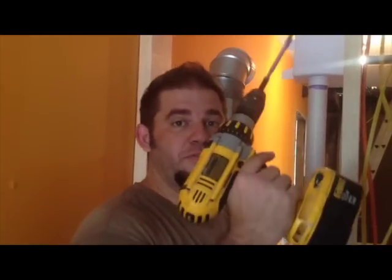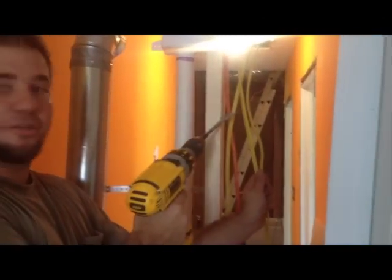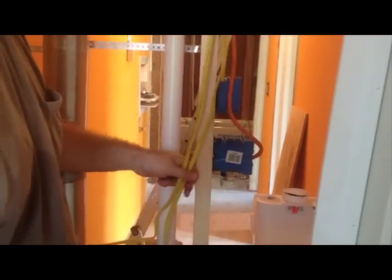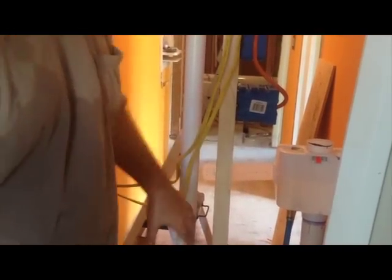You can see my wires — they go up through the ceiling and down here. The way I have them drilled, they come in on this side of the joist. I'd like to have them on this side because down here at the bottom you can see my little water spout where the refrigerator is going to hook into for the ice maker and water dispenser. I'm going to drill a quick hole so I can put the electrical outlet on this side of the joist, because I'd rather not have it on the same side that's feeding water — water and electricity maybe shouldn't be right together.